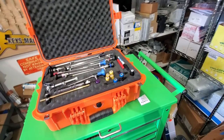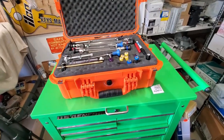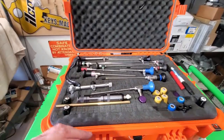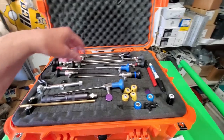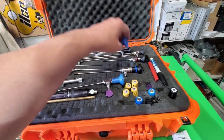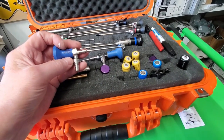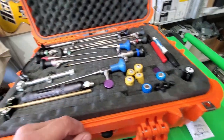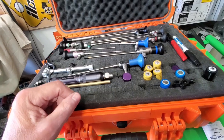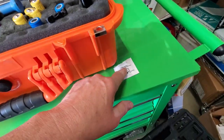Back with you — we opened up that safe. One-eighth inch hole, 2.7 millimeters to be specific for those using metric. I used an eighth-inch drill bit and that guy — that's my Cricket. It was only about four inches deep into the door, so not a big deal. Drilled it, decoded it, repacked it with Teflon, made sure everything was working really nice for the guy.